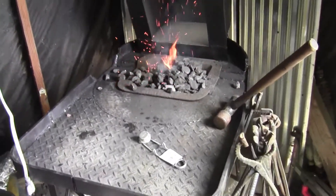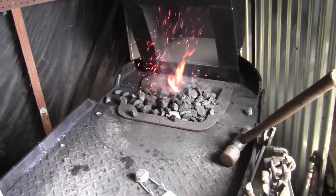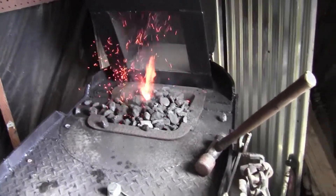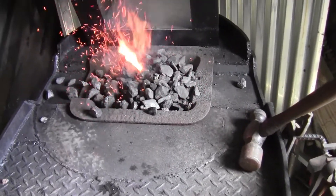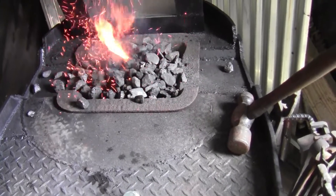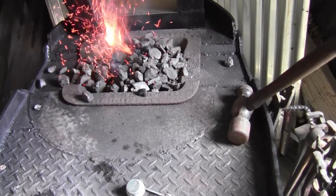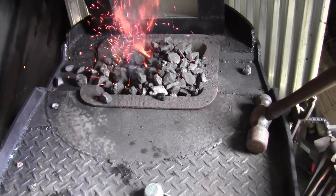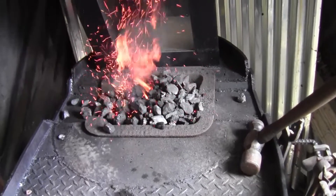I got the super sucker finished, welded it on, put it in the corner, and painted it up. I've only got three pieces of pipe running up through the roof so far — I've got to do the last two pieces and make a cap. I'm on a run right now to make sure the coal is going to get hot, because that was the problem I was having before: it would light the charcoal and the charcoal would burn, but the actual anthracite wouldn't light up. Anthracite has got to have air flowing across it, and it looks like it's got plenty of airflow.